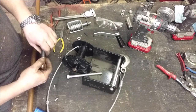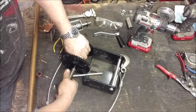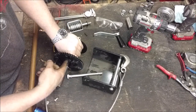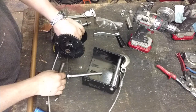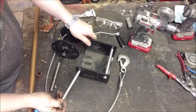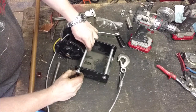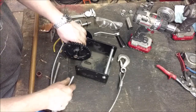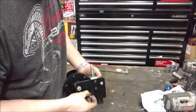I made that into a bushing — it was a little thick so I sanded around the outside. I have one inserted on this side where it's nice and tight; it'll spin, and as soon as there's a major load it'll loosen itself up slightly. I put one in from each side. I also made a small copper bushing for the other area with a lot of room, and that further reduces the slop.